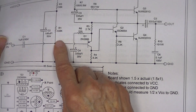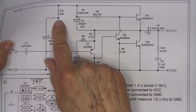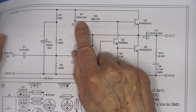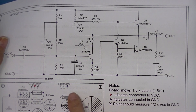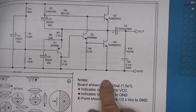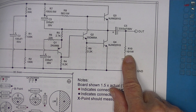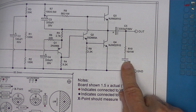There's a 39k resistor up here and a 1 microfarad capacitor. This designer did read the document — half-watt and one-watt resistors are used. We don't have any variable resistors that I can see. And here we have something I've not seen before: a 10-ohm 1-watt resistor and a 1-microfarad bypass capacitor.